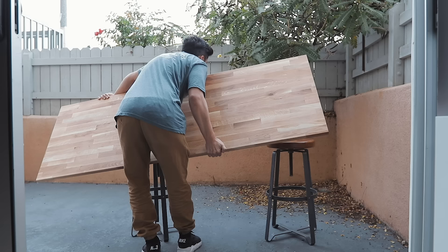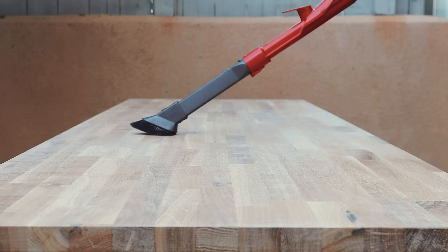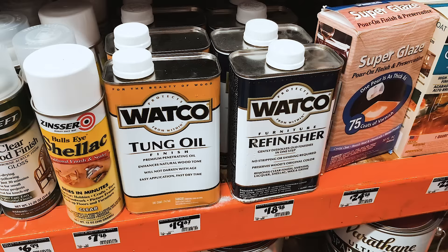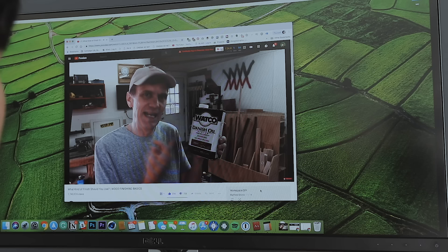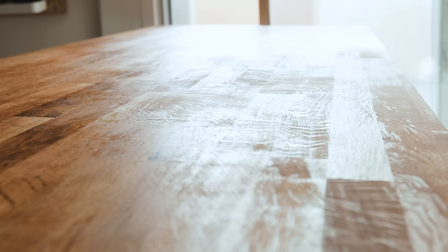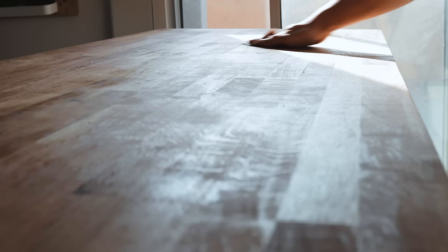To fix the moisture damage I had caused and prep the surface for finish, I sanded down the wood. I started with a coarse 120-grit sandpaper and finished off with a 320 fine grit. After researching the different wood finish options between lacquers and oils, I ended up going with a Danish oil finish. This provided a good balance of the natural earthy look of an oil finish while offering the moisture protection of lacquer. I wiped on two coats of the Danish oil and let it dry overnight. The next day it still felt a little sticky and was a little too shiny for my taste, so I wiped it down with a little bit of linseed oil and sanded down the top layer with my 320-grit sandpaper. This left my desk incredibly smooth to the touch.